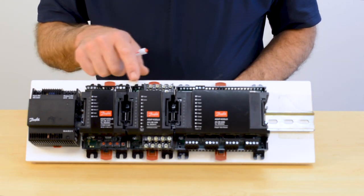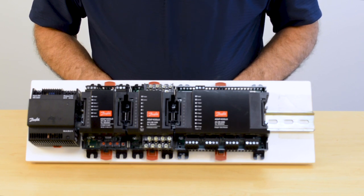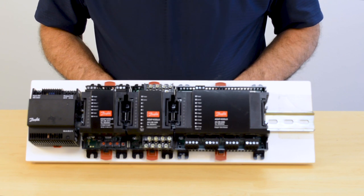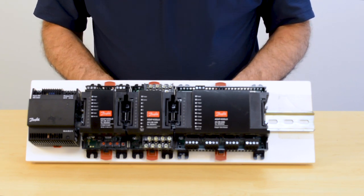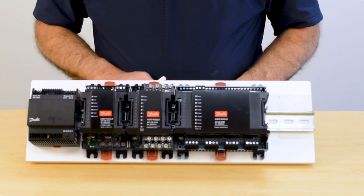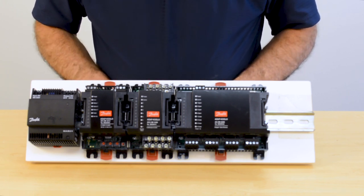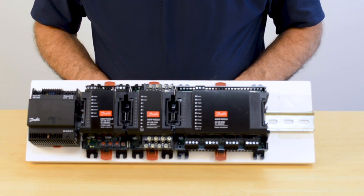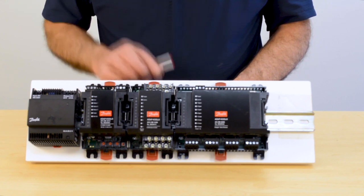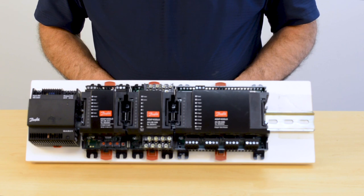As you can see, there are mounting tabs on each one of these modules which can be used, but should not be used unless you have the DIN rail underneath. If you're not using the DIN rail and the bottom surface is not completely straight and smooth — possibly could have a warp to it — that could interrupt communications because the bus line going through from module to module could get out of alignment.